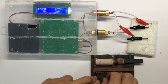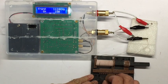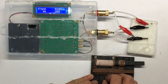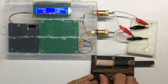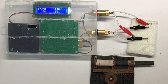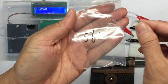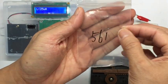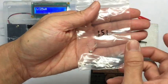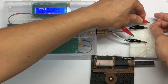Now we've switched the ferrite rod to the more common PC40 ferrite rod with an initial permeability of 2000. Using the 560 pF capacitor for the low band, it goes from a lower Q of 269–270 all the way down to 180. This ferrite material is much cheaper than the R40C1, which is why the Q-factor is also not as high. Now let's switch to the high-band 150 pF fixed capacitor of 10,000 Q-factor.